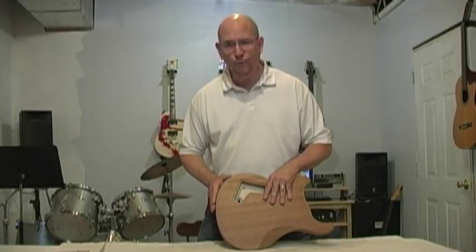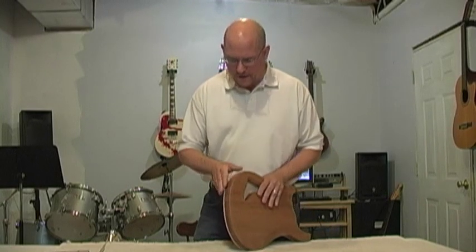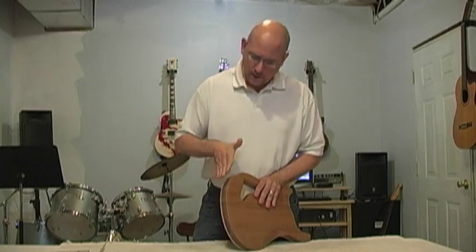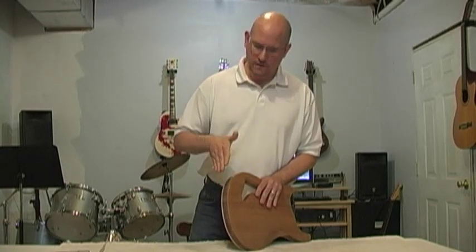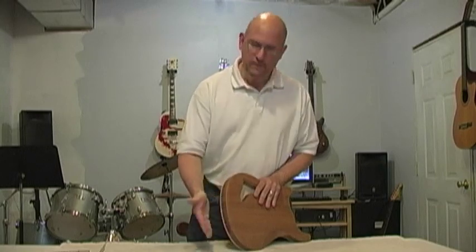And remember one really important rule about sanding end grain. When you sand end grain, only sand in one direction, meaning if you're going to sand down, sand down. Do not sand up. And don't go back and forth. It's repeated strokes down and off the wood, and down.